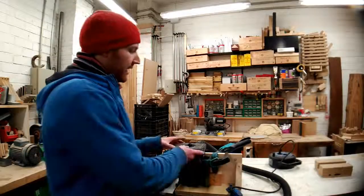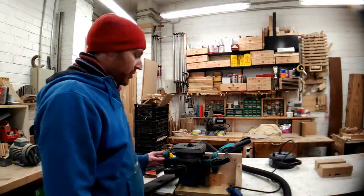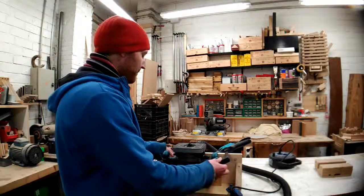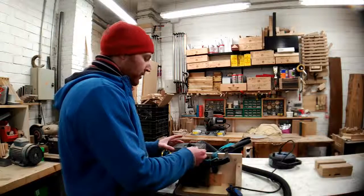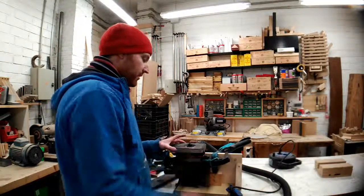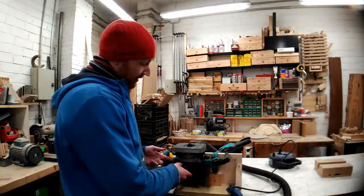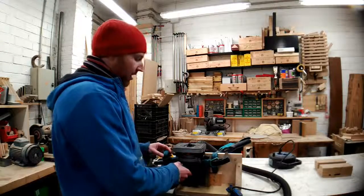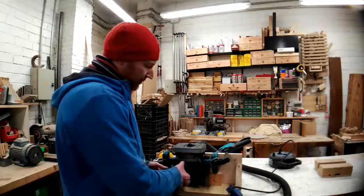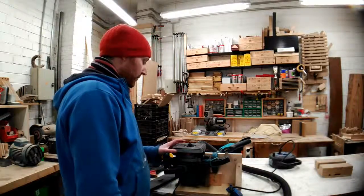Okay, so you've got the router in position. You've got your jig clamped down firmly to the bench. One position should probably be enough. But what you probably want to do is make sure the speed clamps that you're using here to actually secure the tool to the jig are really sound. You don't want any movement there. I use a piece of rubber against the casing itself on the side to reduce the impact of the hard tips of the speed clamp against the actual casing while it's in operation.